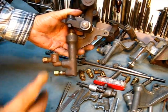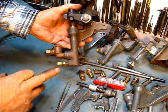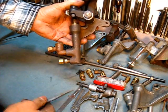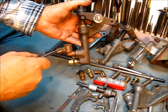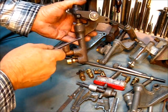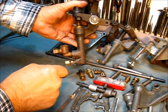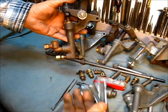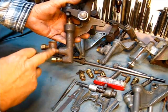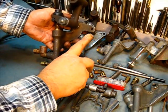This is the first model fuel pump. It's cast iron. The ball in this one is in this check valve out here — you take that off to get down in there to that check ball. The other one is down in this plunger bore right in there. I do have a cutaway and we're going to talk about that. This is the early model, which would mount from the stud to the front.